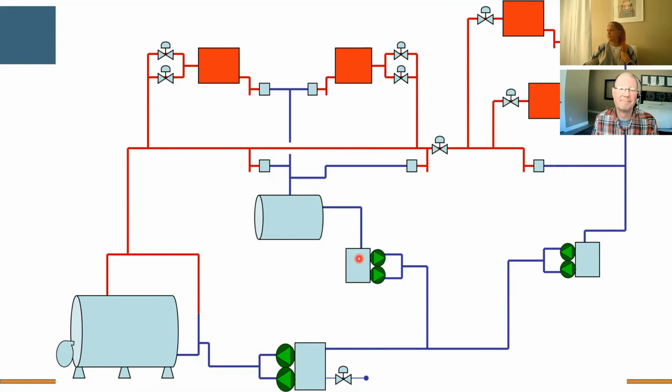So to drain water in the condensate, the pipe has to be sloped. Common would be the same drain slope as waste drain, 1/4 inch per foot or 1/8 per foot. What's recommended? Steam slope of pipe, should it be sloped back to the boiler or sloped to the load?